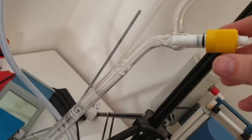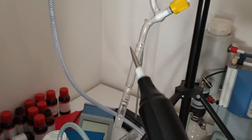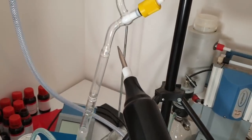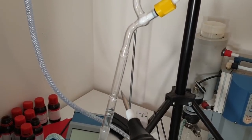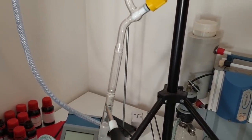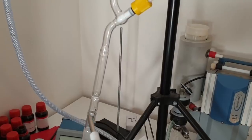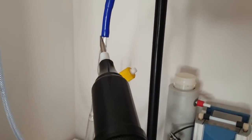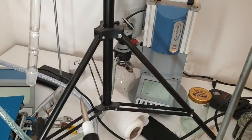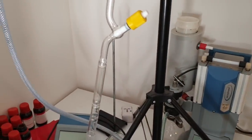Good. Now there's one last test, which is I need to get the high voltage tester on here to make sure there are no pinholes. Okay, there we go, we're up. That means once we can hear the sparks going, and you can get sparks on the end here. Obviously there's no conduction. You only get the conduction once you get to the vacuum. Below the brake seal there's nothing. But it's quite common that you can get pinholes around the brake seal, and if you get those, the whole thing's junk. So we're now down to 1 millibar. I could get the decent vacuum meter on, but this is fine. Okay, so that is one successfully made vacuum seal.